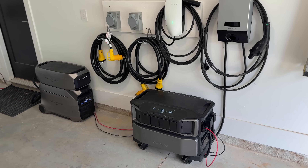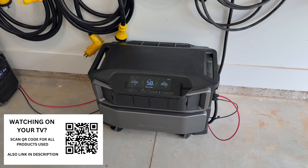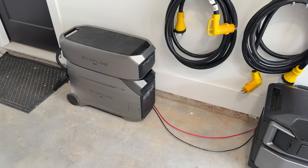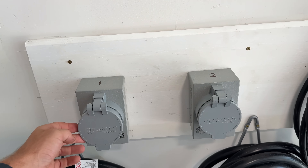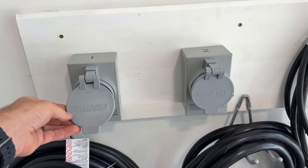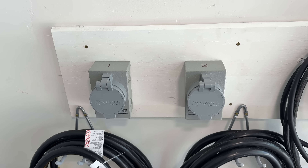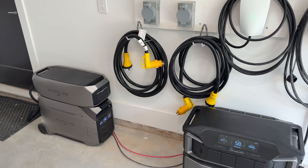Let me give you a high-level overview of the components in my system. I've partnered with EcoFlow and I'm using their Delta Pro Ultra — one of their most capable units — and the Delta Pro 3. I need two units because I have two generator inlets connected to my main electrical panels. These are 50 amp, though technically a 30 amp inlet is more common. I have two 200 amp panels, which is why I need two inlets. Most people will only need one for their home.